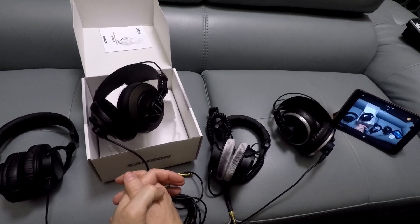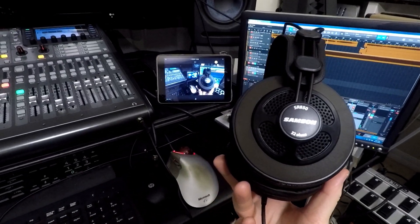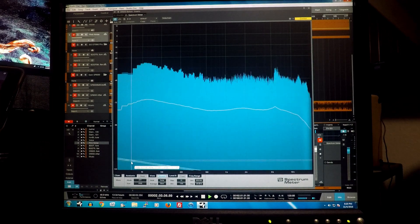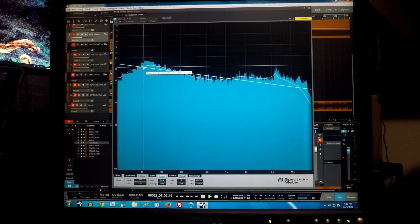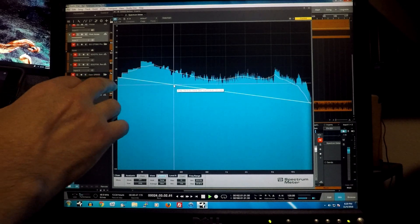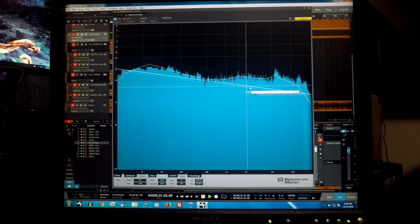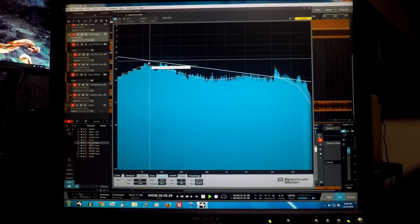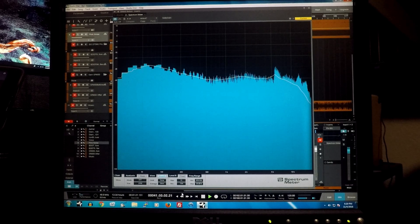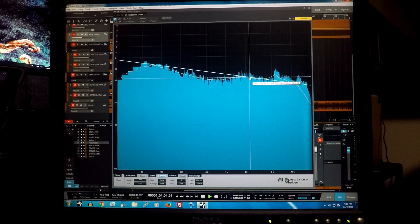Let's see if they respond a little differently. We've got two minutes of pink noise — let's see how they did. Well, I'm really glad I did this little experiment. Not altogether surprising, but interesting results. I'll overlay the before curve. There's an averaging going on — this white line — and that's really what I used rather than following the jumping pink noise. I just used these averages, pointing at various points and getting the numbers. The typical change was like 0.2 dB, 0.4 dB, something like that. There was one spot where it was 1 dB — that was at 2K. Around that range, there started to be a difference: after break-in, there was a 1 dB increase at 2K.